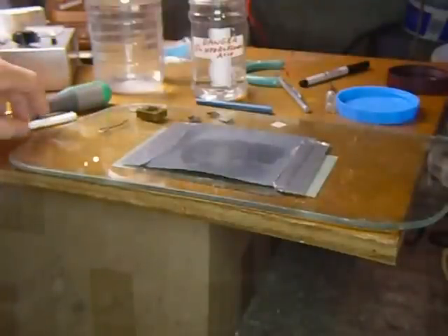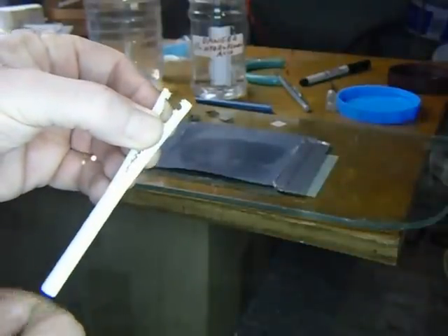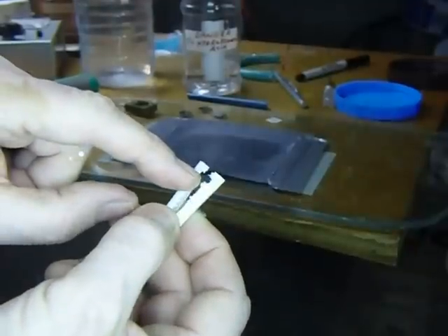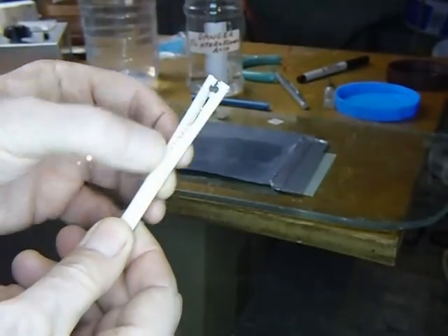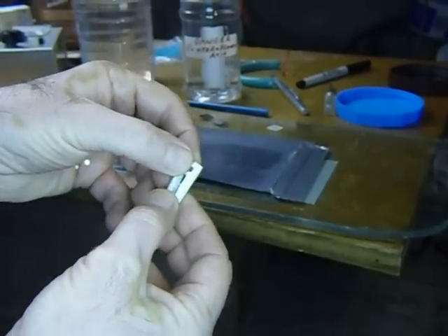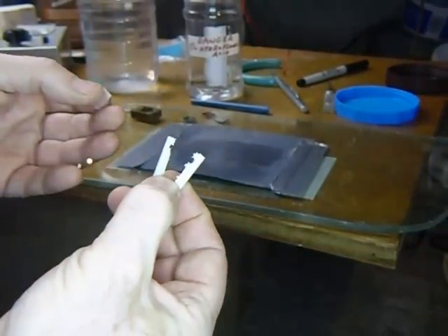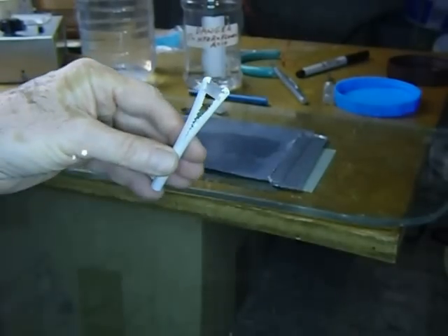When you're starting out you want to etch the crystal, especially if you have to move a long distance — the farthest I've moved one is half a megahertz. What I made up is I took a Bic pen, pulled the ends out, and drilled a hole — about a 5/32nds hole, though it can vary. Then I took a hacksaw and cut it halfway down. It's not pretty, but that doesn't hurt a thing. To put the crystal in, just hold it in one hand, spread the holder — it's springy — put the crystal down in there, and you're ready to go.